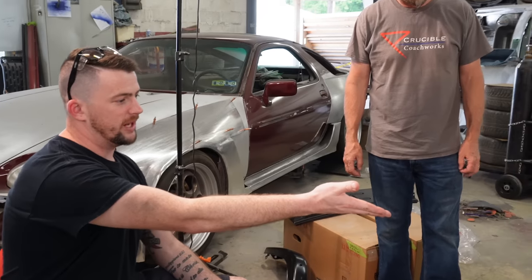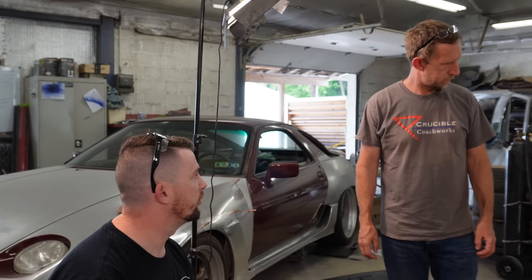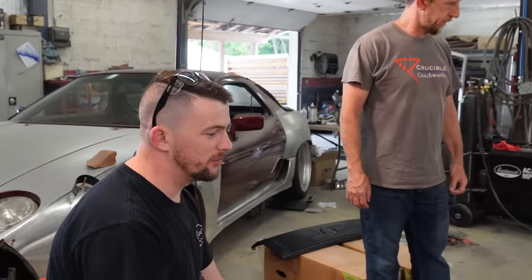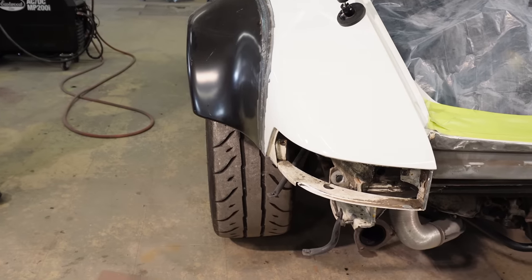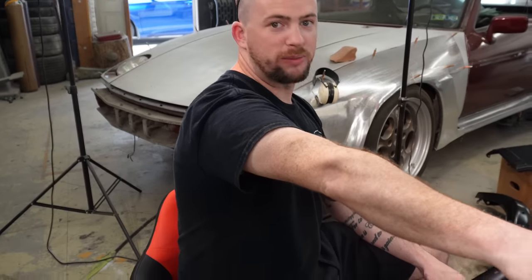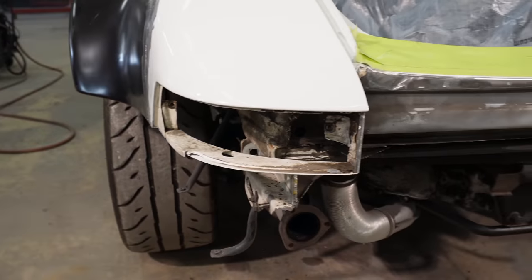The way they're stamped, aftermarket quarter panels are not perfect. Like anything that's pre-stamped metal, you have to modify it to be what you want, or what the car needs. Both. What I want and need is to cut that off and re-flange the bottom, because I want a perfectly crisp line across the whole bottom of the car, between the bumper and there. So that's a big detail part of the car.